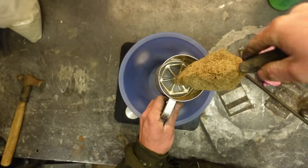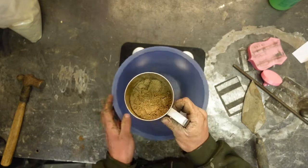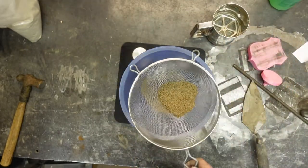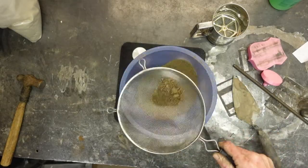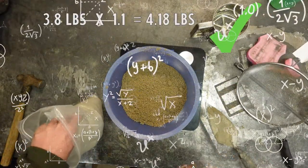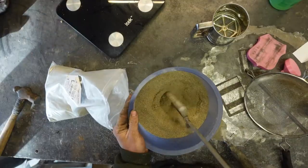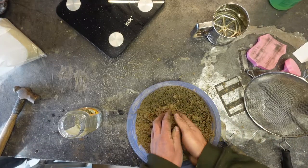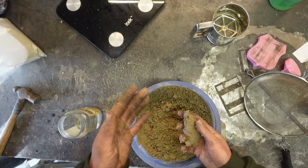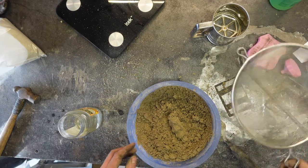To make this green sand we're just using a regular bag of Home Depot play sand, but we only want the fines from that. So we're going to painstakingly sift it through a colander — though apparently there's an easier way. We want about 10% bentonite clay, so we're looking to get up to 4.2 pounds. You want to make sure the bentonite you use is also a powder. The bentonite I have came as a powder — it's something my girlfriend uses for her hair. But if you just buy plain kitty litter, read the ingredients, make sure it's just bentonite, and then you can grind it up in a coffee machine and sift it through a sifter like we did with the sand.